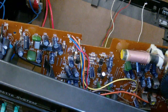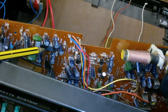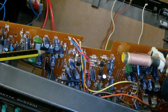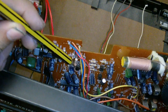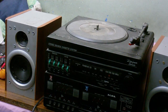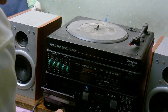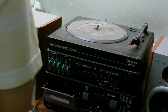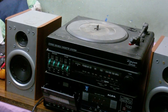Just about to put it back together, and this is a bit of a letdown right here. You know what this is? It is an integrated circuit — this puny little chip is the actual amplifier. There's a Zener diode and a transistor as well, so I know this part is the power supply. Let's see if this thing actually works. Got it plugged in and turned on — I'll put something on the tape — and yes, it does work. I can hear a pop in the speaker every time I activate the tapes, which tells me the power for this thing is not constantly on.